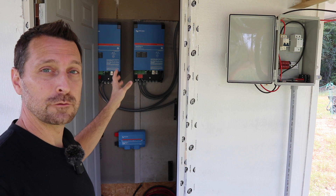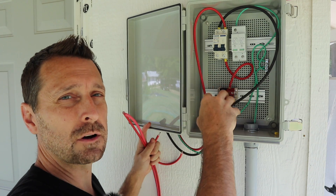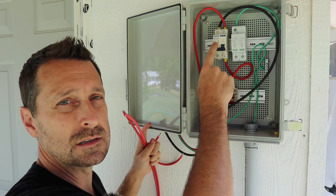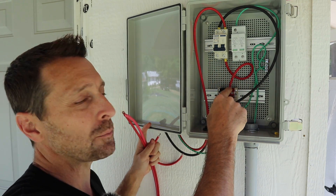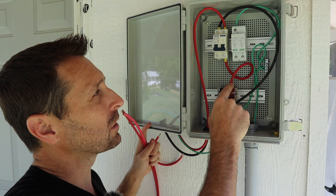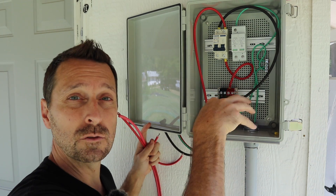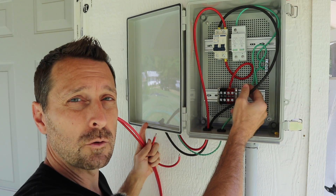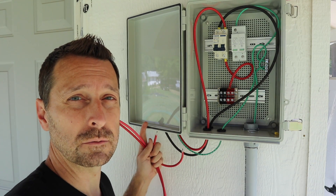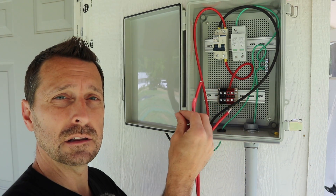Before we take you inside to complete the wiring for the inverters and the charge controller, we need to finish this combiner box on the outside. Inside our combiner box we've got our two PV lines coming in from our panels to the positive and negative on our DC breaker. From there we've got a short jumper from the positive down to the red on our terminals on our Dinkle din rail. From here we are going to go up to our SPD. That SPD is grounded to this ground bar and then down and out to our grounding system. We also have the equipment grounding conductor from our panels into this bar as well, and that goes out to the entire system.